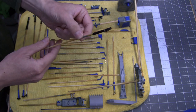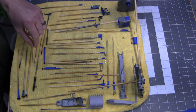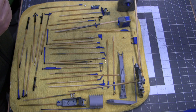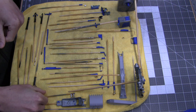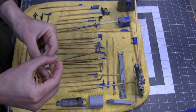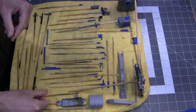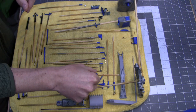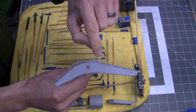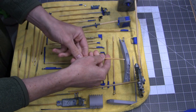And then everything is just rigged up, ready to get painted. Anything that I don't want paint on, any contacting, rubbing surfaces, I have blocked out, like you can see right here, just to make it an easier process so that I don't have to clear too much stuff out. Some stuff I didn't bother because I'll just go back through it with a drill bit in my fingers, like right here, and clear that out. But it's ready for paint.